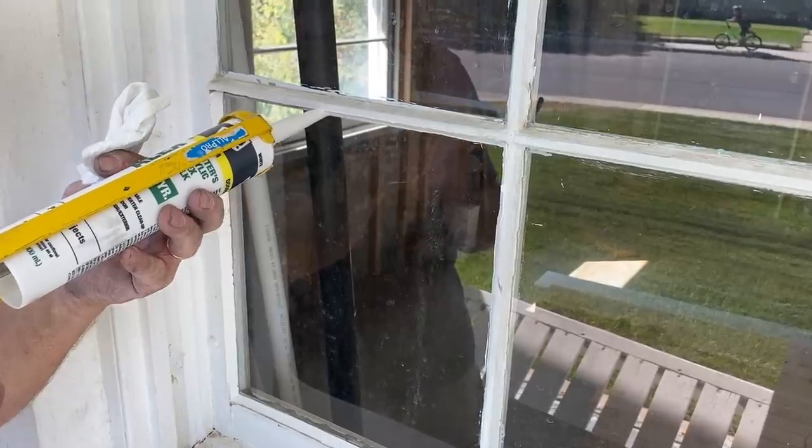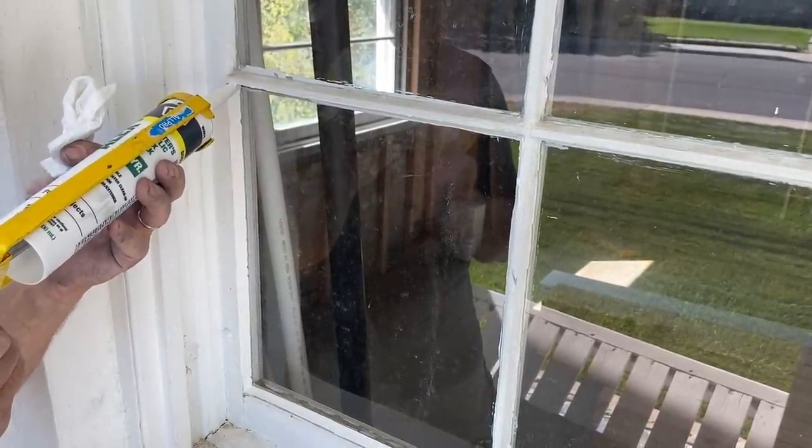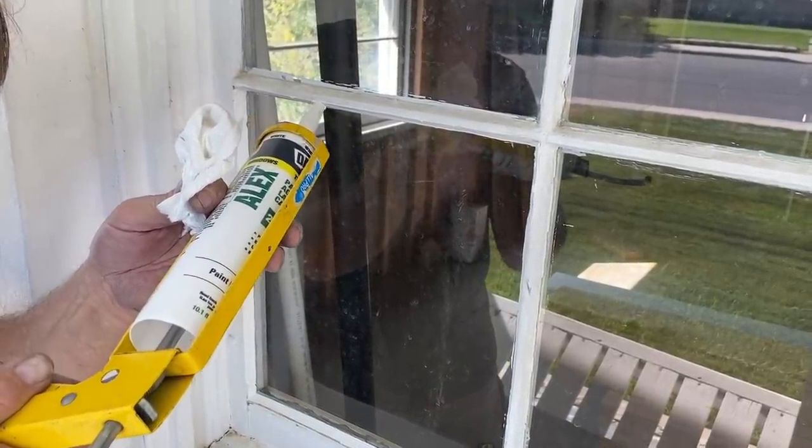I am loving the way this door turned out. I can't contain my excitement because design stuff totally gets me super excited. I had no idea how gross this looked with that storm door — it was totally dated, hiding the amazing beautiful door package that was on here. Jeff's going to take the old glass and repurpose it. Now we just have to finish the rest of the house. We're going to seal this door up with Sweet Pickens top coat tomorrow. Make sure you're using a water-based top coat, and if it's facing the sun and not covered, make sure you use something that's UV resistant. To find the paint and products we used, go to jamierayvintage.com — it helps support our channel. Be sure to give us a thumbs up and subscribe to Jamie Ray Vintage for more DIY.